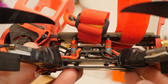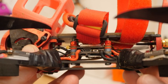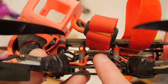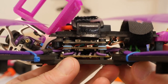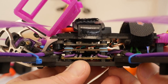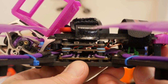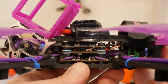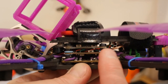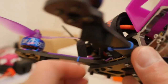This is my red quad — this is just a double stack with the Matek F405 CTR all-in-one board, and just above that the VTX 5848. And this is the Rooster — it's a wee bit tight in there. At the bottom is the Mamba F405 30x30 stack: 40 amp ESC on the bottom, then the F4 flight controller, and just above that the VTX 5848. You can see the two buttons for changing the power level and channel on the side of it.